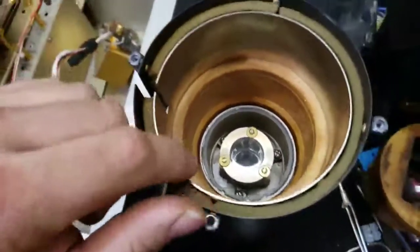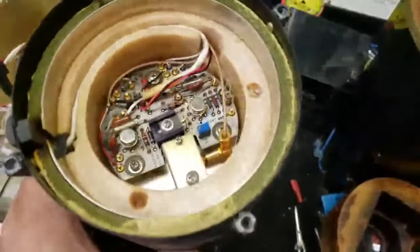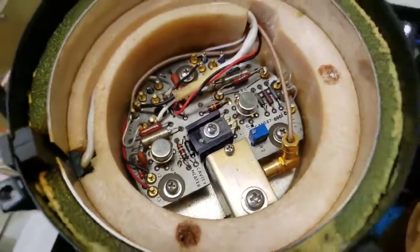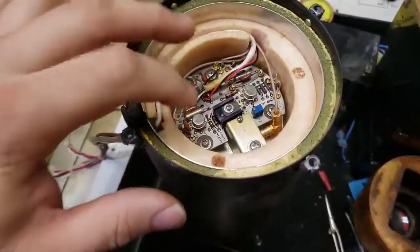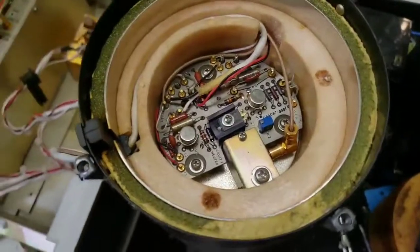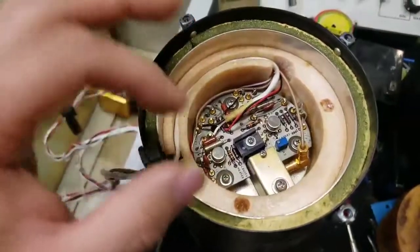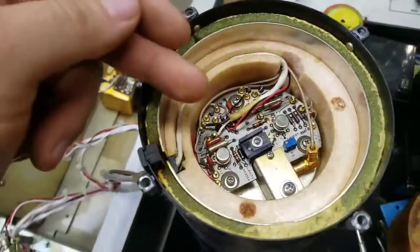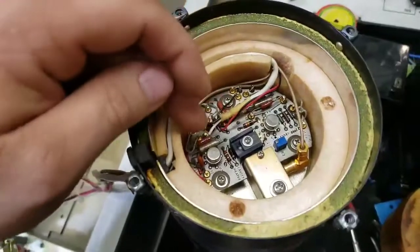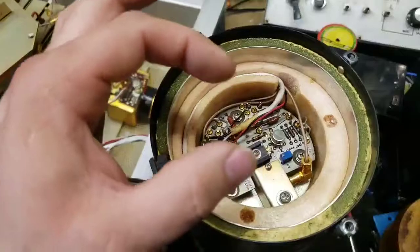This whole thing is heated, which is why it's insulated in this chamber. At the very end there is a photodetector. Think of it like a photovoltaic solar cell that detects the light coming from the rubidium lamp. Whenever you get a perfect standing wave, everything cancels and you get no light — or very little light — coming out onto the photodetector. So what the system does is adjust the frequency of the light to dial in that standing wave perfectly.